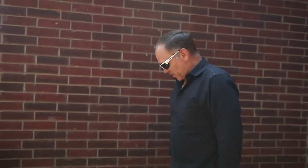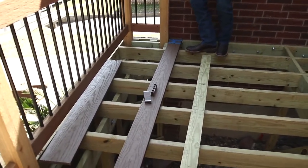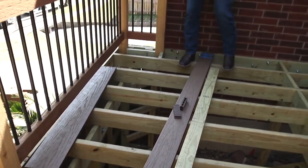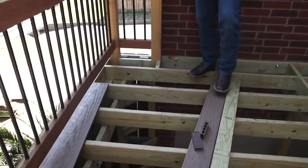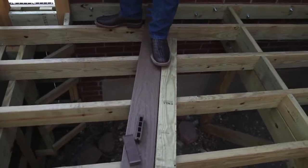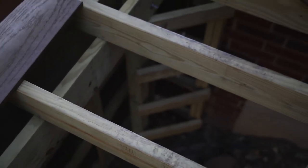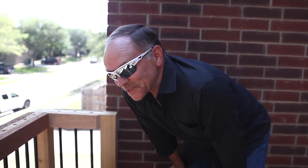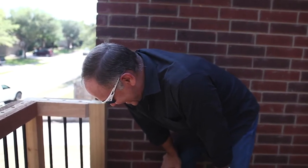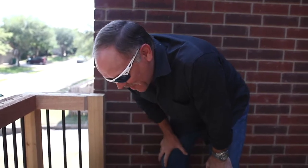Look at this little ladder here — I want to show that. I'm going to compliment your ladder, little ladder bracing here. That was cool. Can you see that? Step on this, Justin, and you'll be fine. Look at that ladder bracing — to brace the two corners together, he put on some little brackets. Plus when he was up there, he probably wanted to get on top and climb up a little easier too, right? Yes, sir. It supports it really well. It keeps you from wiggling while they were framing it — keeps all that locked in together.